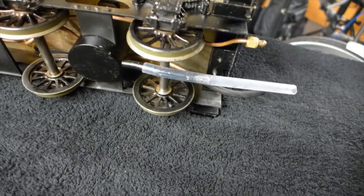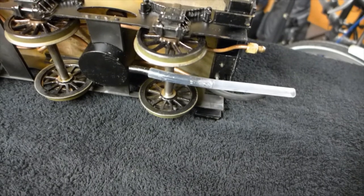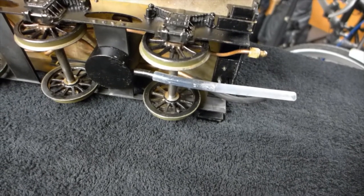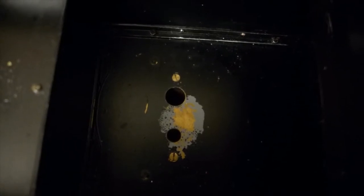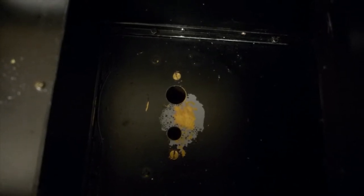the locomotive burner. Although the sump is quite large, if you filled this in a manner traditionally, as with a Mamod, you would have to be stopping every few minutes to pour some methylated spirits into the sump. Another factor to consider when using methylated spirits is to be very careful not to drip it. Even this small amount inside the tender has removed some paint, and it's very easy to take the paint off your precious models and very easy to remove lining.